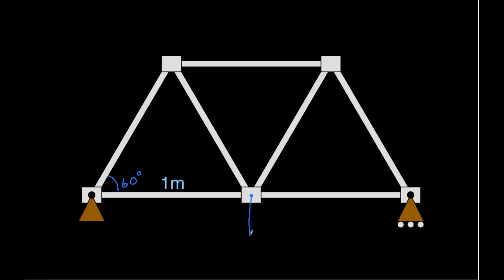The truss has a load of one kilonewton at the center. With these dimensions and load, this truss might represent a small footbridge with a fairly chubby person standing in the middle of the bridge. We begin by drawing a free body diagram of the whole truss to find the reaction forces, and will then go joint by joint through the truss to find the tension in each of the members.